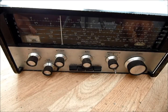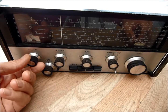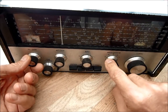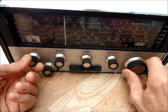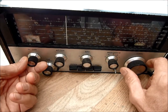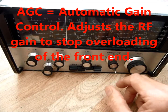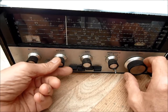Let's see how it performs. Obviously no warm-up time on this because it's transistors. We're on the longest wave bands here — band 5, which is 550kHz to 1.5MHz, which is mostly broadcast bands. We're going to put the AGC on because broadcast band stations are very strong, so the AGC will work fine on that.